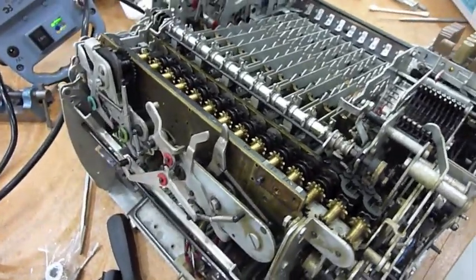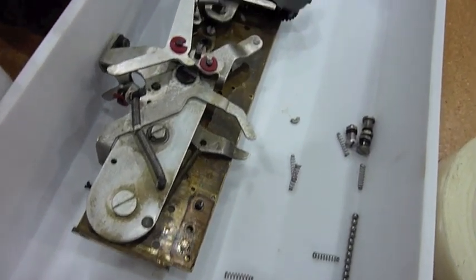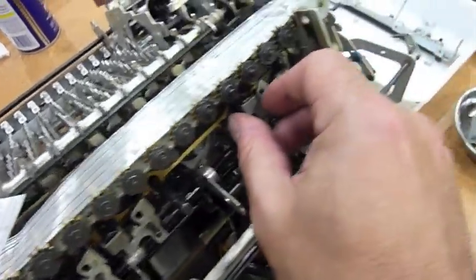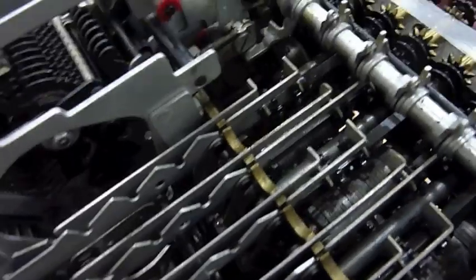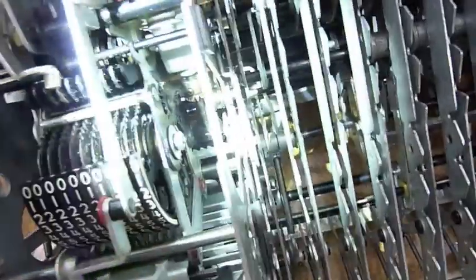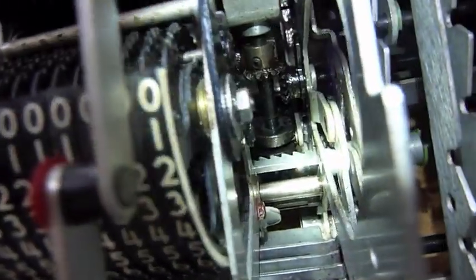I'm going to take another try at disassembling the back plate, this time removing all the screws. The whole plate at the back came out, and fortunately I found all the balls — this was a little scary, but I got them all. The operation was successful. Now I can wiggle actuator 4 and eventually it came loose. Now I can see it sticks down a level further. I checked actuator 6 — it wiggles. So it's just this one. These two gears down there are stuck.